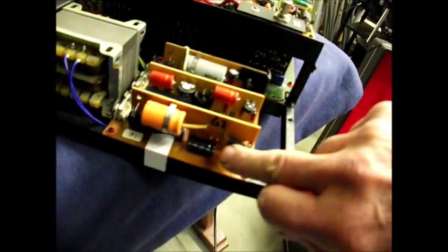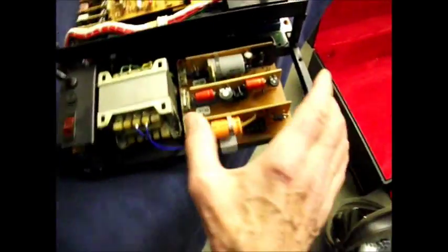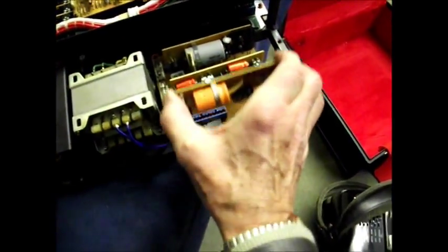First thing I've got to do before I go testing it is get the heatsink on this voltage regulator, which gets pretty hot pretty quick. But they are infamous for getting hot. So let's get the heatsink on this board before we go pushing our luck and burning out the voltage. Oh, excuse my French. Burning out the voltage regulator.